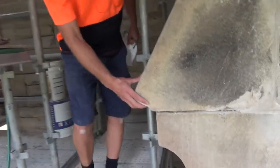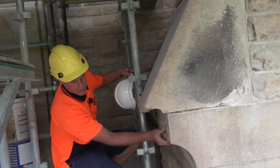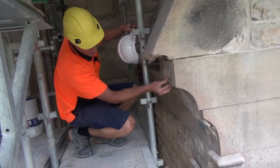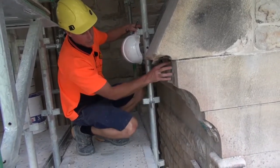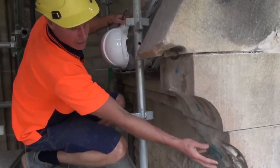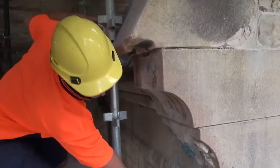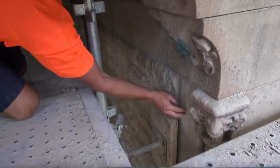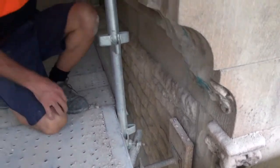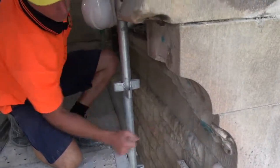These same stones have failed, same detail — the stones will crumble in your hands. So what we propose is mortar patches here and also a stone indent to get the carvings back in. Here's a perfect example of more exfoliating stones, and existing cement mortar that we'll be removing. It is long overdue.